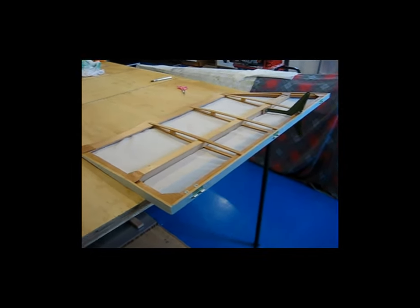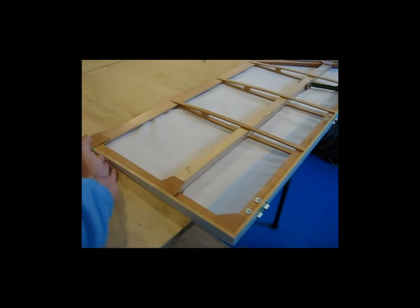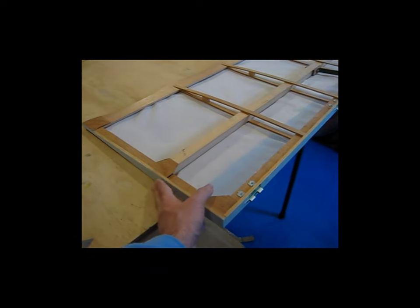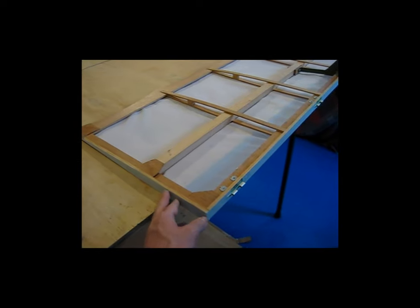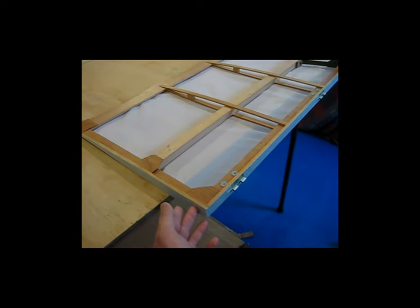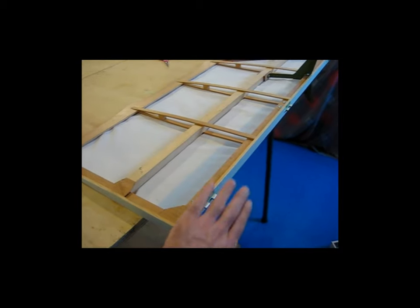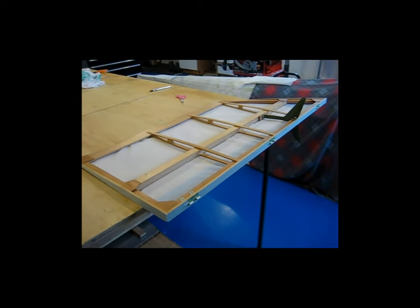Now I'm going to do the final gluing. I just come back with a brush and put glue on all of these surfaces. Then while it's still wet, wipe it with a rag that pushes the glue through the fabric into the underlying substructure and the underlying glue. By wiping it, you keep the glue excess to a minimum. The glue dries really quickly and if you leave it wet, that thick wet glue will actually show through the fabric and possibly through your final paint. So get it good and wet, wipe it, do that final gluing, and then it will be time to do the initial shrink.